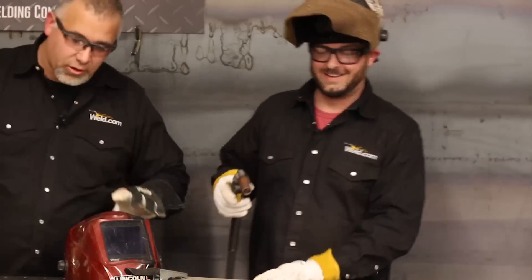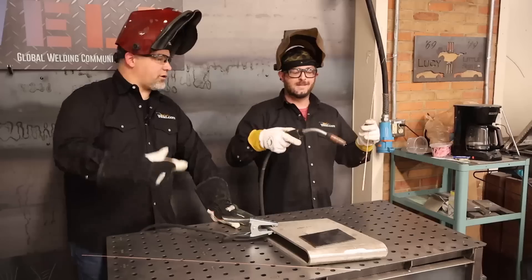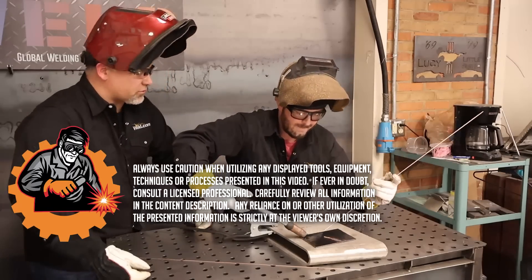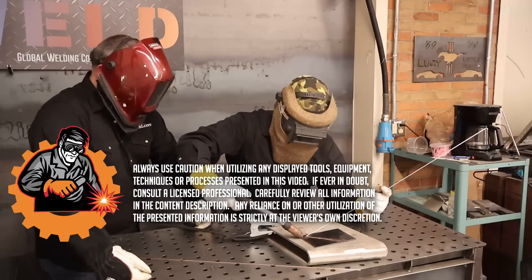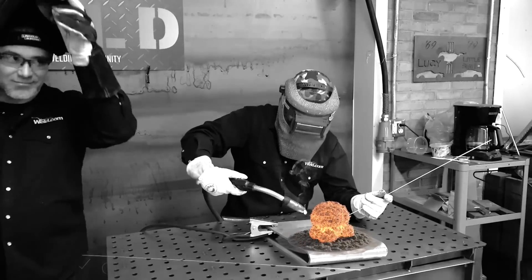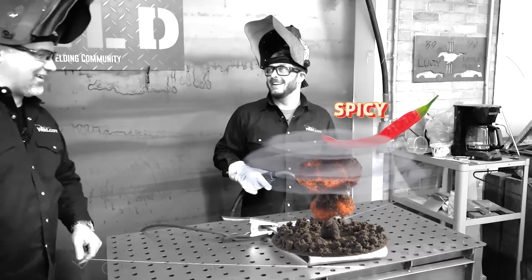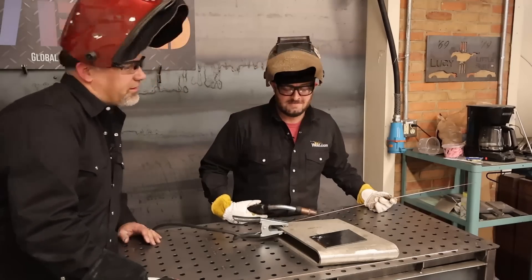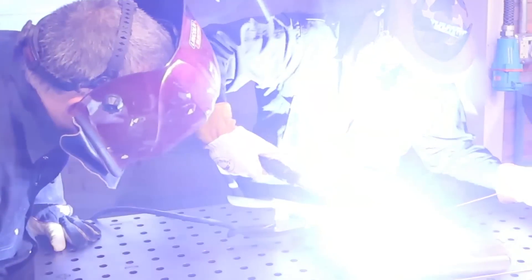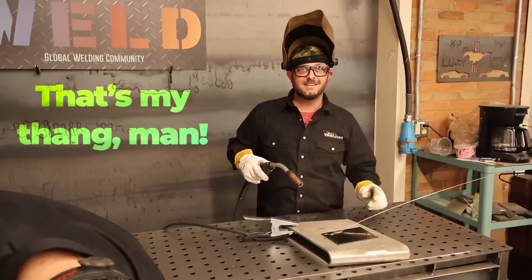All right, I'm going to give you a choice. We'll see what happens. Get in position just like you would be TIG welding — you just happen to have a MIG gun instead of your TIG torch. Do your drag run. Good practice. So it's a little spicy — 23.5 might have been a little high. Let's try 19.5. Let me drop this down a little bit. That's still pretty spicy. You stuck your filler.